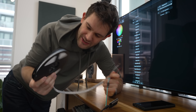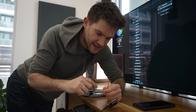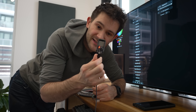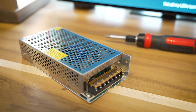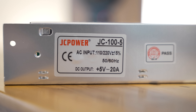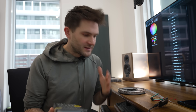This is actually quite a long roll of LEDs, and it's going to pull some serious amps. So if I tried to connect the LEDs directly to the control board right now, I'd probably end up frying this little control board. That's why I got a five volt power supply. This takes 120 volt AC power from the wall and converts it down to five volt DC power and injects it into the LEDs. Theoretically, these LEDs shouldn't flicker because they run on DC power — the flicker you get in many LED lights is caused by AC power.